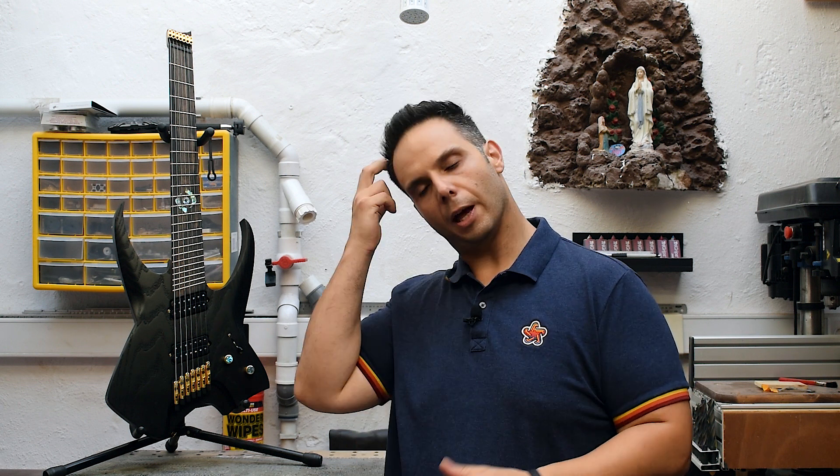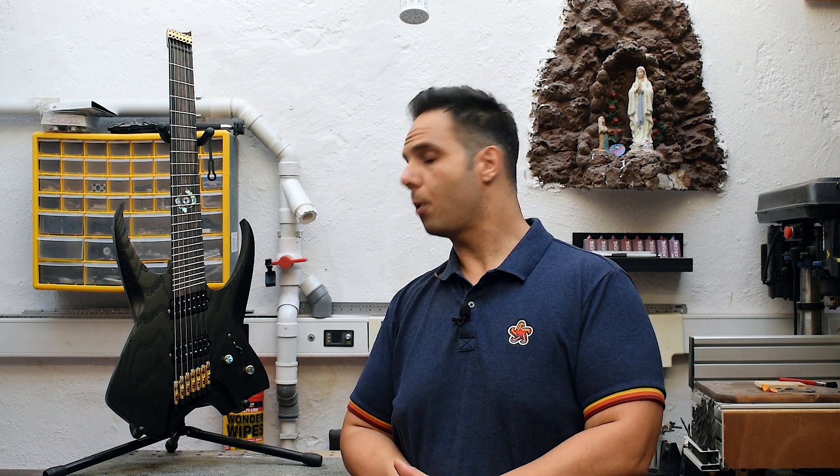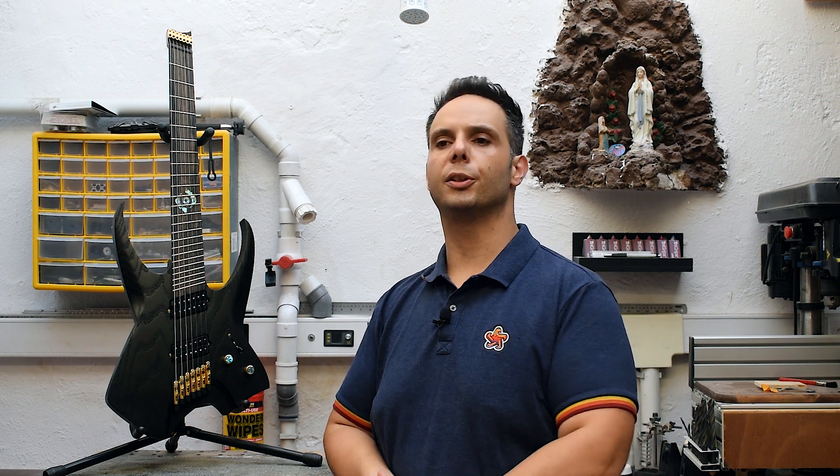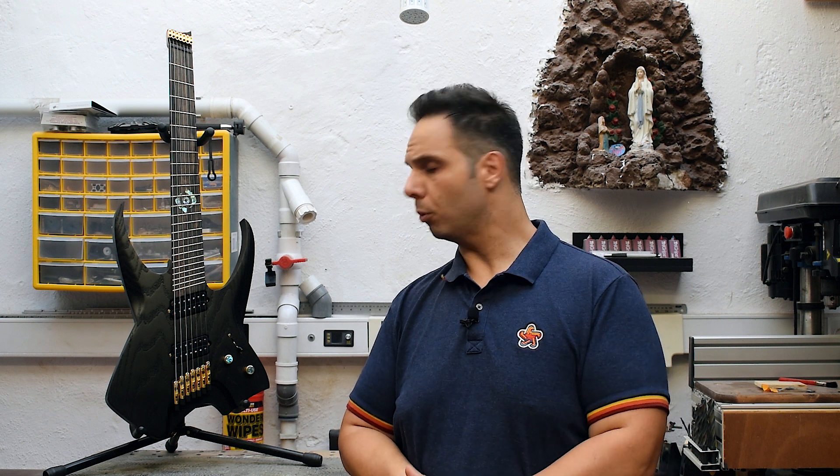And today, I'm just going to talk about the finish and a few mentions. I want to thank some people regarding this. Now, regarding finish — as you have seen from the previous footage, I went with a flat black finish on an open pore ash. I didn't do grain sealing or whatever. One secret about this kind of finish is to brush with a wire brush — as you saw me do — the pores, just to remove any small fibers that block them.